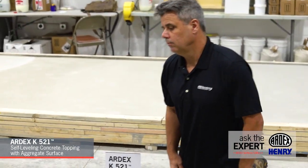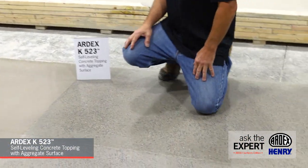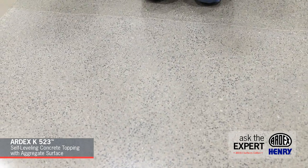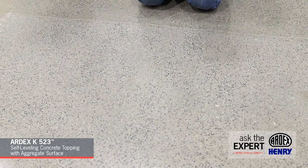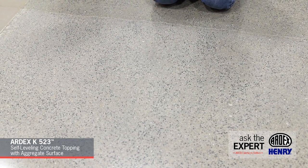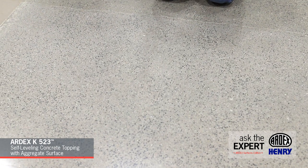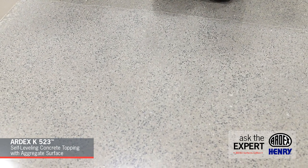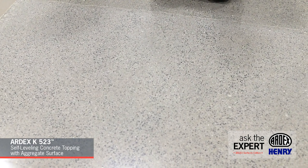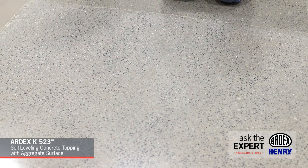The final product in the K-Series is the Ardex K523. This is a very unique product and one that I think truly reflects higher aggregate polished concrete. You'll see it has a black and white aggregate with a nice distribution of material. It is not terrazzo in the sense that it's not completely uniform — it gives you a traditional polished concrete, a more natural look. You'll have higher pockets with more aggregate reveal than others, but it truly reflects polished concrete better than some of the other products.